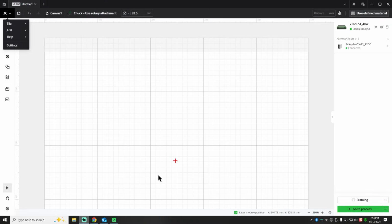All right, guys, so the testing is done, and I'm just going to stick with 300 millimeters per second at 50% power. Every test I've done, that particular setting did a really good job. With Cermark, it's doing the gray engrave, so maybe it's just this glass, but we're going to rock with that. It gives it a good look, and it's actually something that you can't get a lot of times. So we're going to go with it and use that look as our target.